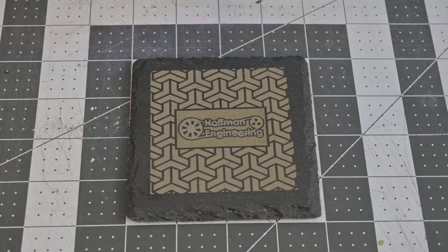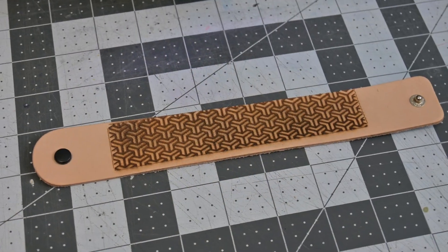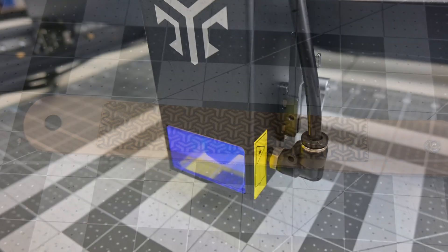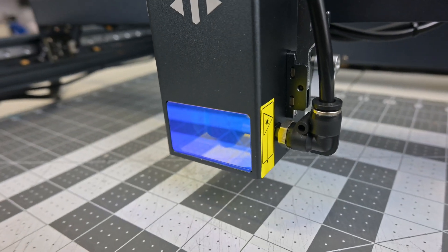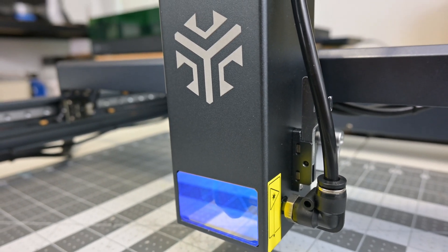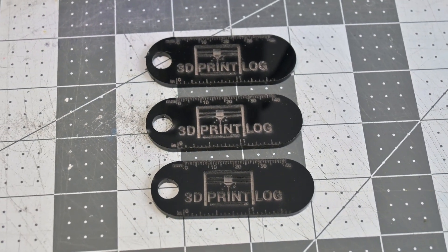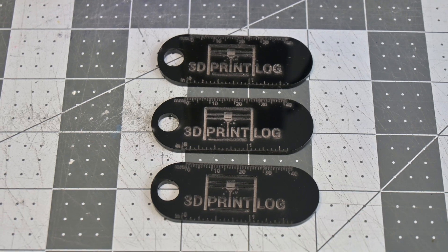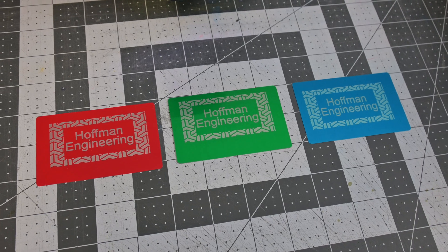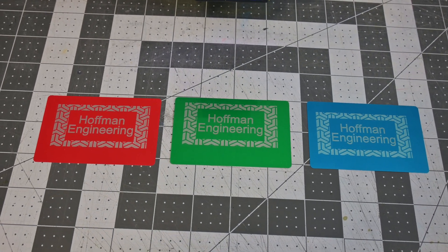Slate continues to be one of my favorite materials to engrave and the P2 did an excellent job with it. My leather test turned out great with deep and consistent engravings, though I did not do a good job of aligning the laser — the laser opening is in the middle of the module from left to right, but it's closer to the front than the back, making eyeballing the position a little tougher. Diode lasers cannot cut clear acrylics, but opaque acrylics work great. My ruler keychains have accurate measurements and the engraving is crisp. Aluminum also worked great — the red and green engraved very cleanly, and the blue just has a small amount of coating remaining when using Acmer's recommended speeds.